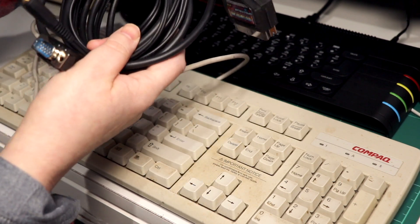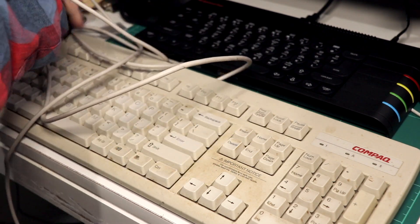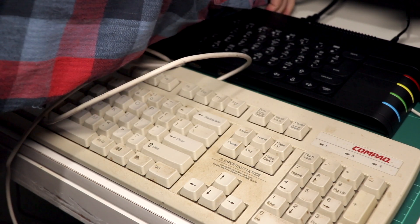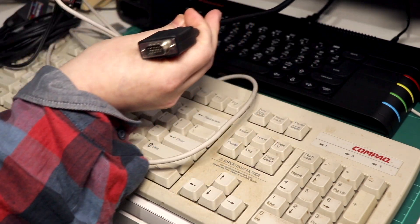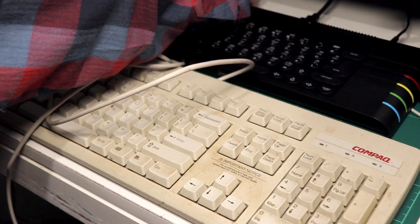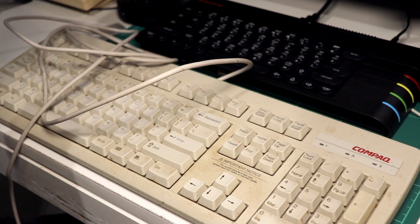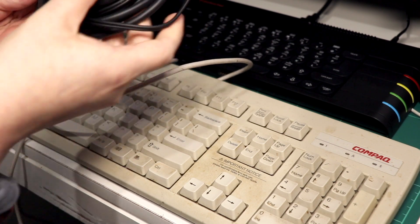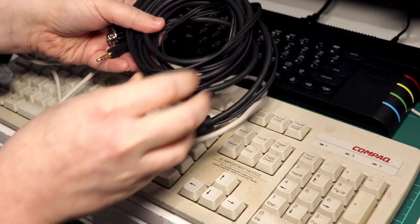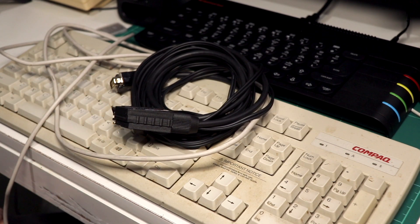Third are video cables, both RGB and VGA. Though most cores will work with all three of the Next's output options — HDMI, RGB, and VGA — it's worth noting that at the time of recording, a subset do not. Having a VGA monitor will really serve you the best, at least with how things are at the moment. Things will obviously change sooner or later, and hopefully by the time Issue 2 machines come out, all three options are supported for all cores.